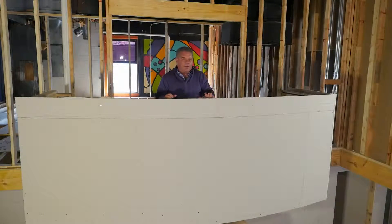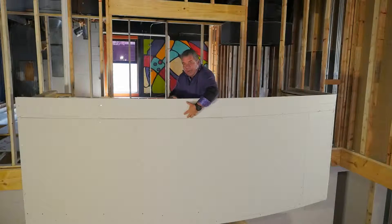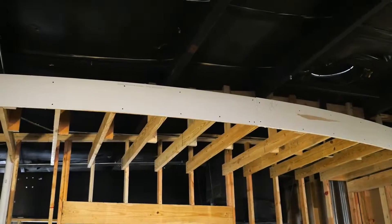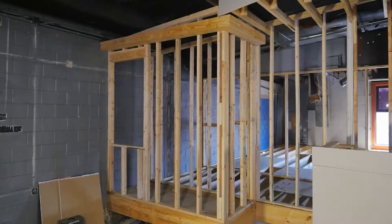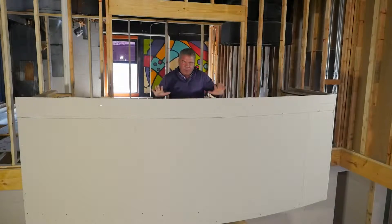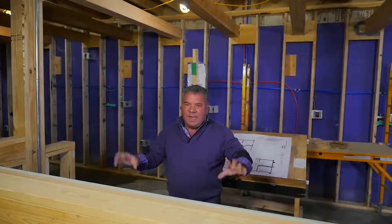The section I'm standing in here is basically a full balcony. This section of the building — the left and right hand side — will be stucco, with decorative tiles mounted flush with the face of the stucco. The capital here will have a crown mold detail out of stucco to give it some character. The far left and right hand sides will be brick, and the center section will be stucco, so we'll have two different looks on each side with this building section in the middle. This area I'm standing in will be the cappuccino espresso production line. I've raised the height of this wall to hide the look from the customer side. The beams overhead give a look of the exterior — the whole design here is to feel outside while you're inside.